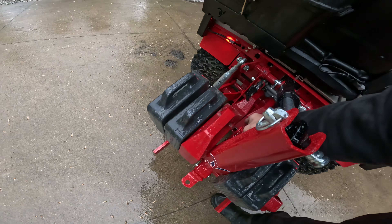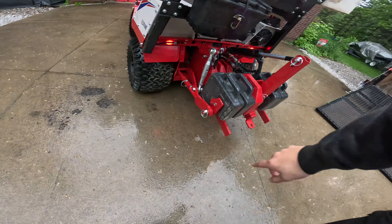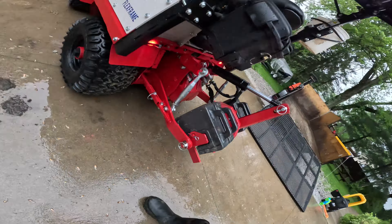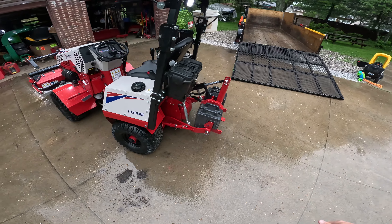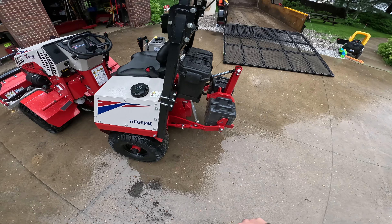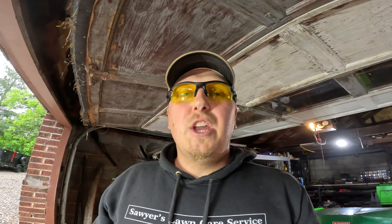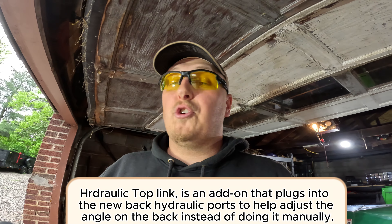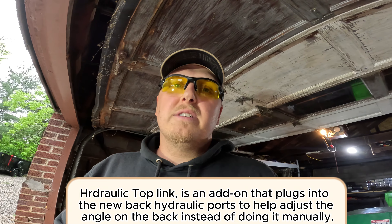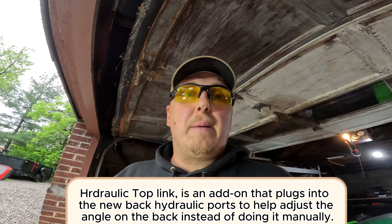You just flip this up — it releases the hooks that are down there — and it allows you to hook up the leaf plow, any straight blades, any other three-point attachments. You can take off the 3-in-1 adapter and the power bucket. I found out, talking to the dealership, that you can absolutely use the grapple on the back. You just can't use the hydraulic lift cylinder on the back at the same time as using a grapple on the bucket. So you can use the bucket and the cylinder, or unplug the cylinder, put on the manual arm, and then you can run the grapple on the back. That's how that works.